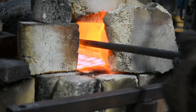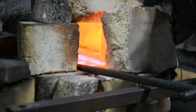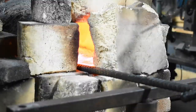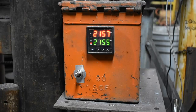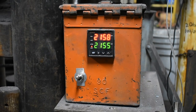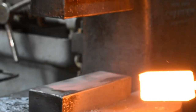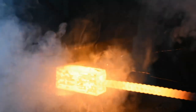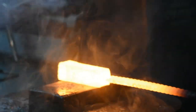And here we're putting an oil-soaked billet right in, and we're going to start heating it up for the forge weld. Shut the door, and now I've put a heat shield on so my handle doesn't overheat. Forge is up to temperature, and that billet's going to soak for a minute. And now we are banging away. Forge welding is on the 300-pound Beaudry mechanical power hammer. Check it out.